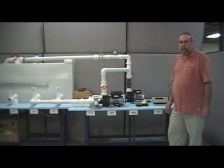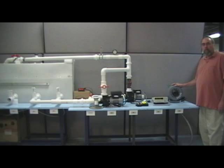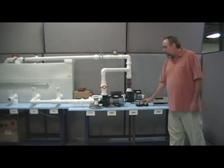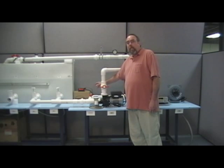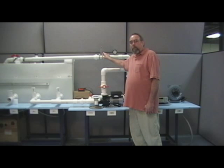To prove our demonstration accuracy, we are using a 220 volt variac power supply, a digital watt meter, an RPM gauge, a digital flow meter, and a pitot tube flow meter for gallons per minute comparison.